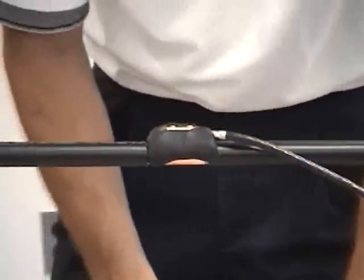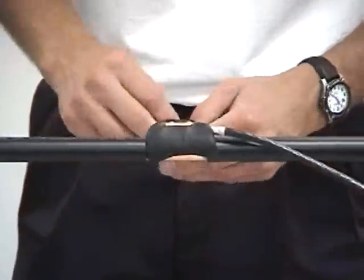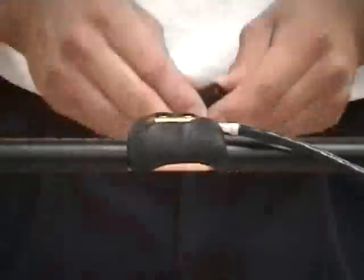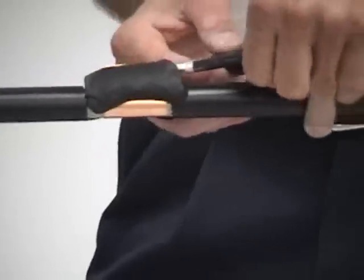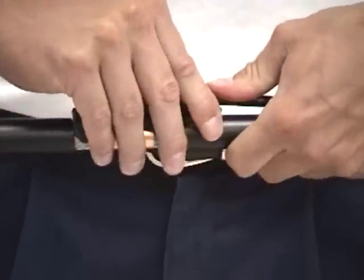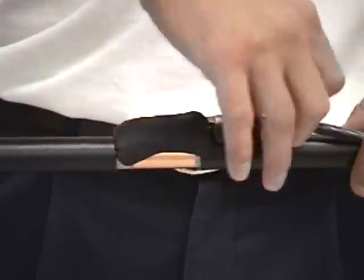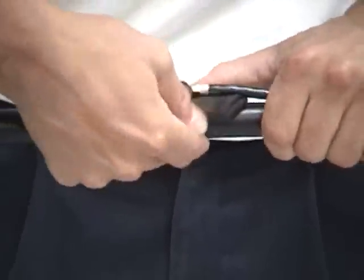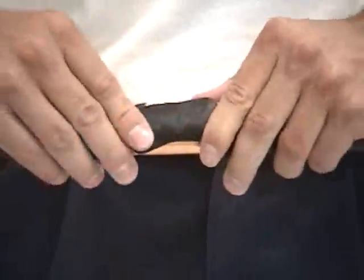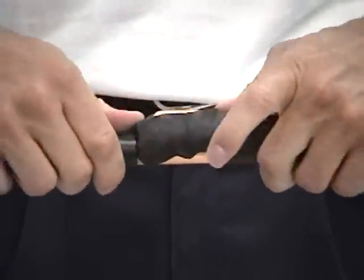And you're going to cut one more small piece. You want to take this piece and tuck it right under the wire. Right down on the edge here. Just kind of push it up like that and press the wire back down into it. That's going to keep any moisture from getting up underneath, so that every point the water could get in is completely sealed. Like I said, just make sure it's nice and smoothed off so you don't have any large ununiform lumps.